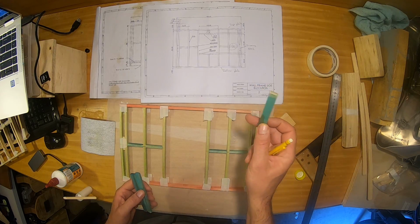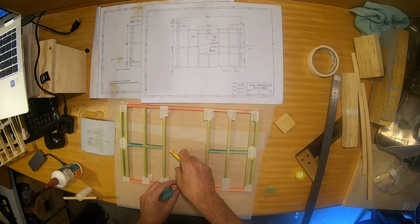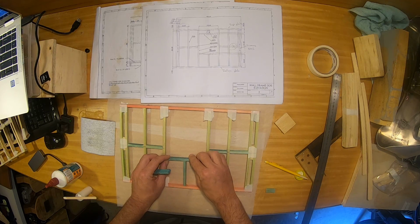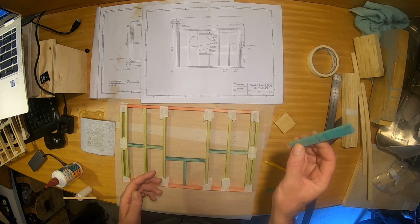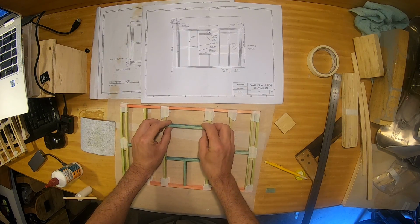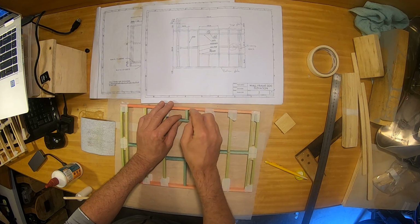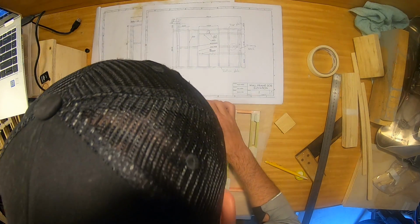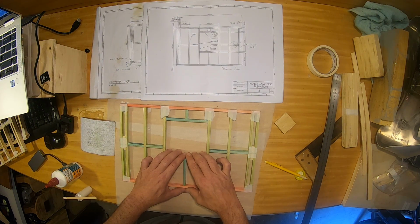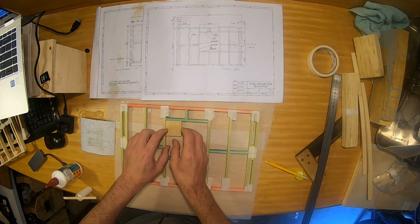Alright, I've got my support stud here, which is going to go in at the bottom. So I'm going to lay that in. I'll take my sill trimmer, I'll just lay that in, like so. I'll then take my lintel, which is right at the top here. Notice I'm putting that center mark facing up. I actually have a little jack stud here, so I'm going to put that in. I'm just going to use my mark off my top plate and my center mark there to get those correct. And now I've got it lining in there pretty well. I'm going to come back over the top and glue in a little while, but I'm just going to check for square on all of those.